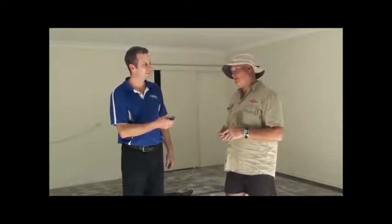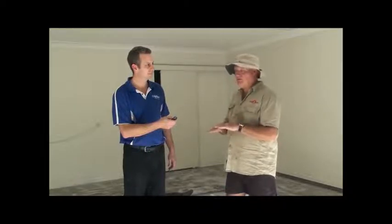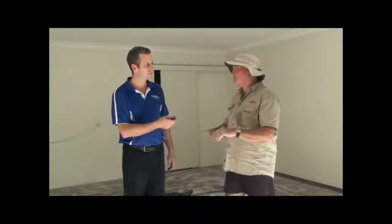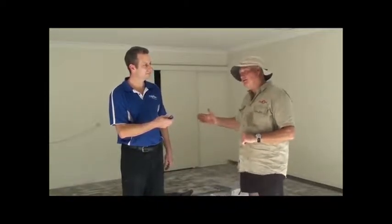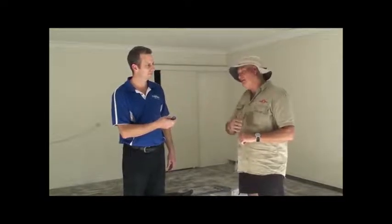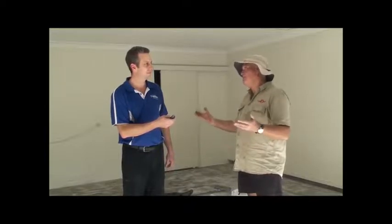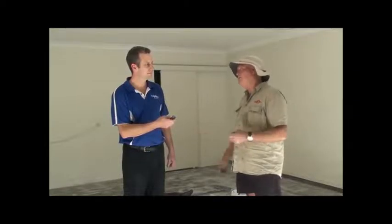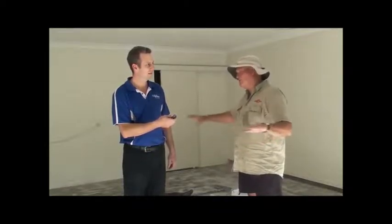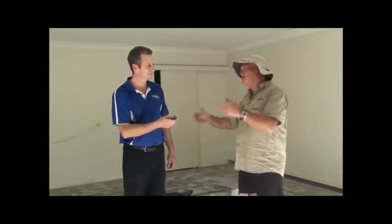So really it's just ensuring that you've got that 250 odd micron of epoxy sitting on top of the slab. If it is a porous one, then it may mean rolling it out, waiting for 5 or 10 minutes, and then maybe mixing up a little bit more and just topping up areas. It'll tell you where it needs more. It'll show up, and we just roll out and back roll it, let it sit. Yep. And once it sort of stabilises, then we can cast our flake.